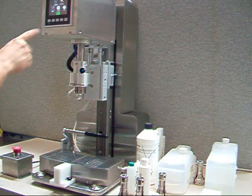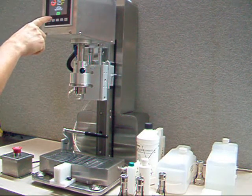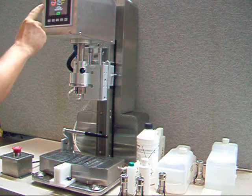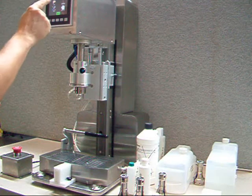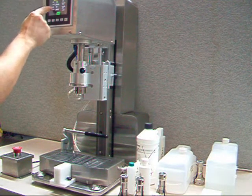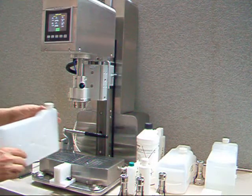When you start the setup, you would have to go to the main menu, which you can do by navigating on the PLC screens. It's a touchscreen HMI PLC, and you just press the appropriate buttons on the screen to get to the next level. I want to go to the setup, and the password here is 1111, and then go to the manual mode to manually actuate the platform or the head up and down.